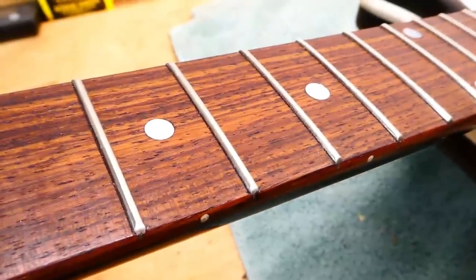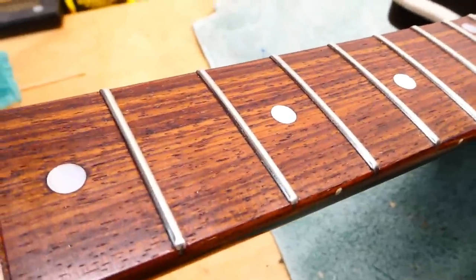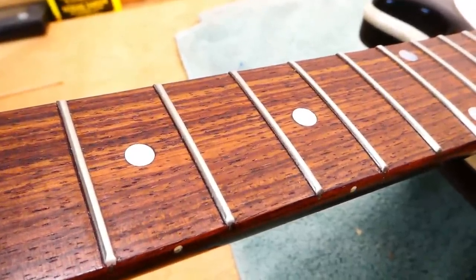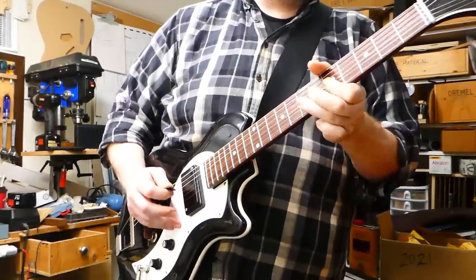So the board is looking good. It's time to apply a light coat of tung oil, which isn't made from tongues — though it smells like it. This makes the color pop, does very little to protect the wood surface, and certainly doesn't feed or nourish the wood, just makes it look pretty, and maybe slows down the transfer of moisture a little bit from board to the air — but that's debatable. Mostly it makes it look pretty. These new frets are almost twice as tall and about 30% wider than the old ones — much more substantial feeling. Let's plug it in and see what it does.